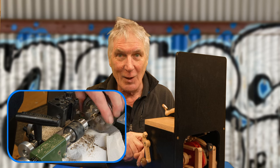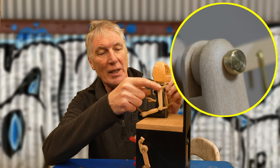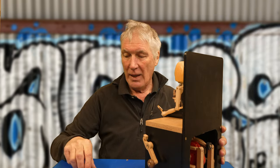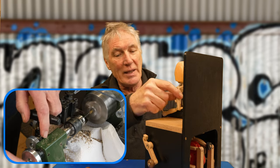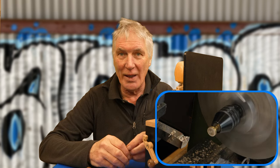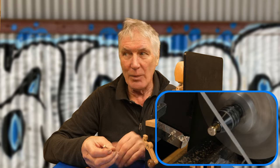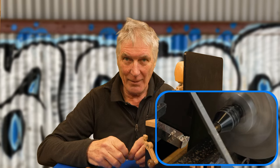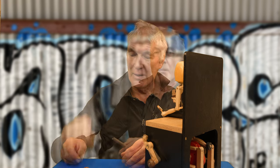Number four: pins. I use pins a lot for putting arms on, putting crank knobs on, and mounting gears. In the past I would use wire for some things and just bend the end, but you can't use wire for everything. I tried cutting them from solid brass rod but that seemed wasteful, so now I drill a hole in a thicker piece and put the smaller piece inside, glue it, and finish it off. There's a slight issue that 2mm stock is a bit loose in the lathe, so I made a small adapter using a mini hand device that goes into the chuck.